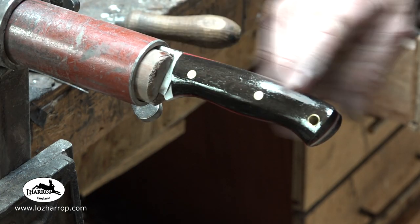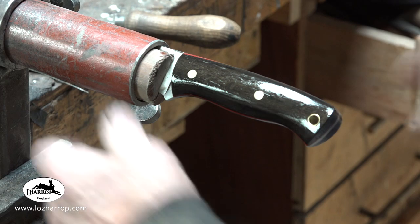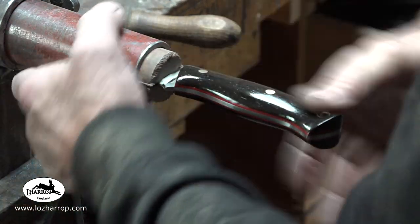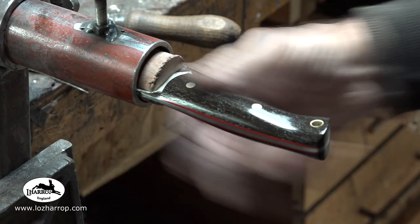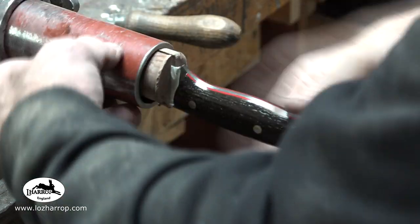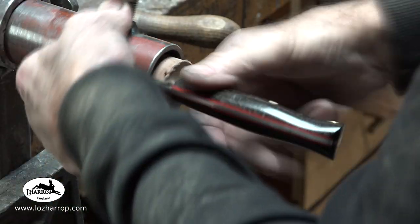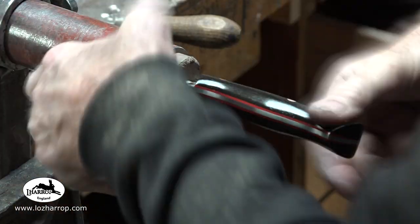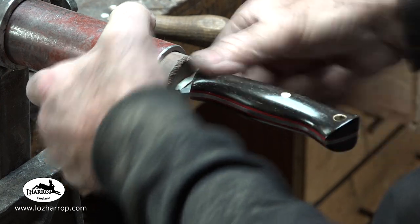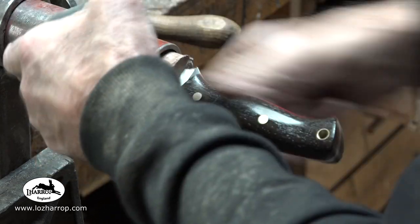If you just leave that on there, flooded on the surface like that, and let it dry, it will leave a horrible sticky mess. So I'll generally leave it about 3 or 4 minutes, and then I'll wipe it off. But what I do before then is I just go over it, rubbing it in the pores. The friction from doing this actually dries the oil as well, makes it start going tacky, but it ensures that all those little pores and open bits of grain are filled with oil. As the oil starts tacking off, it kind of pushes them in as well. And you usually need 3 to 4 coats of this oil, on the bog oak ones anyway, to fill the grain in.